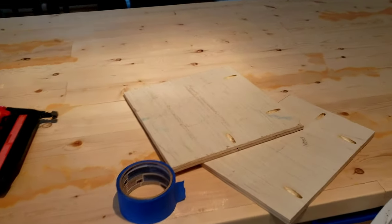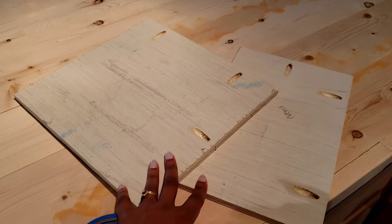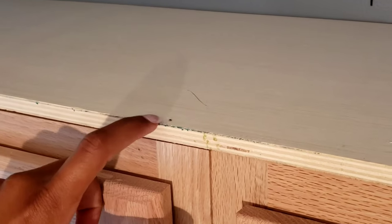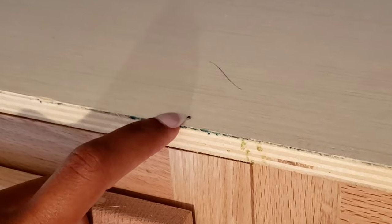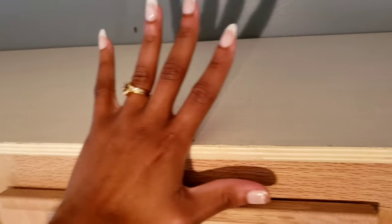To install our upper shelves, these will be going on the sides of this top shelf right here. I first cut the wood to lay across here, then go in with my nail gun and nail it down all around the perimeter — all across here and one in the very back — and that secures it down to the top of the cabinet.